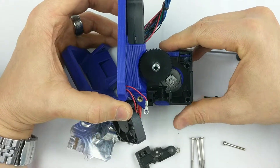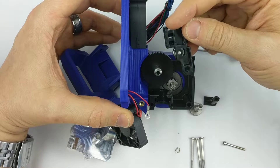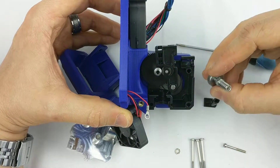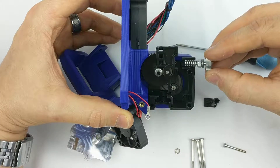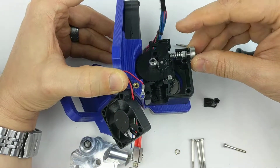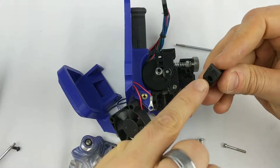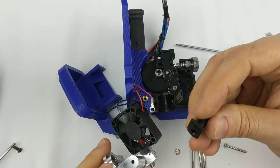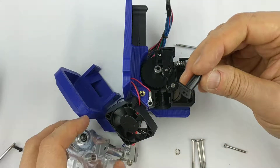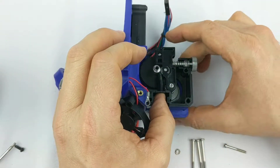To put this back together, just reverse the process. Take your idler — you'll notice there is a little nub right here. That nub needs to face the spring. The bearing side goes against the hob, and the nub faces the retaining spring. So this just drops in onto the motor shaft. Take your idler tension knob and spring, usually at an angle, place it against the nub, and tilt it down into position. Give it a little twist so the nut settles itself. On a 1.75mm, there's actually a PTFE tube that goes from here into the heat sink, and you can insert it into that hole to hold it in place. On a 3mm, you don't have that.